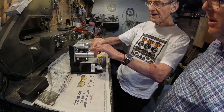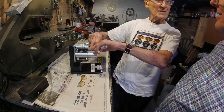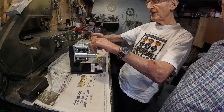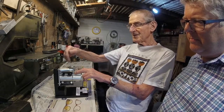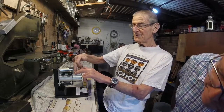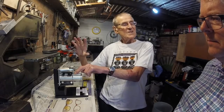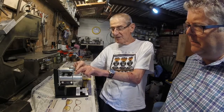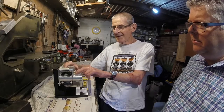The rollers press down and it's a bit like the steel track focusers that were being sold. John says he invented this concept — he thought of doing it for the very first Crayford, but decided to keep it simple. Two rollers pressing down on there, independent of the pinion — totally independent. There's an adjuster inside that presses a separate carriage down and also presses a rubber. The pressure on the kinematic balance is independent of the rack. The focusing pinion is a rack and pinion on a separate carriage. There's no backlash in the focus itself — backlash is only in the rack.